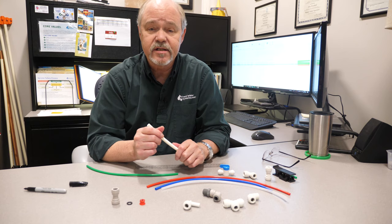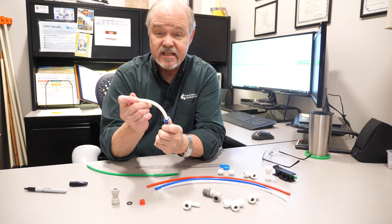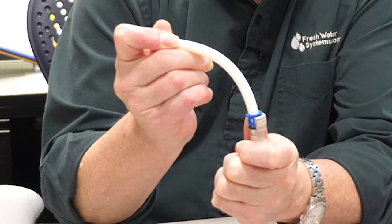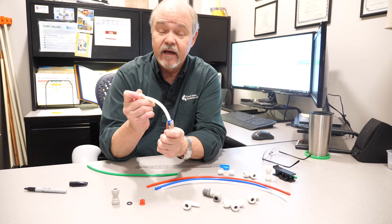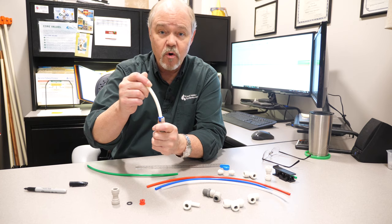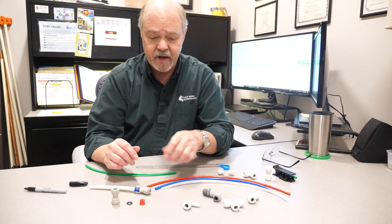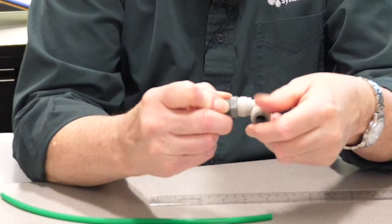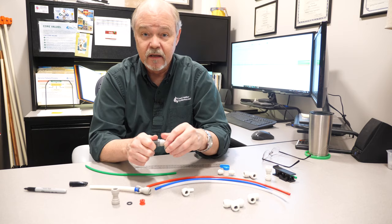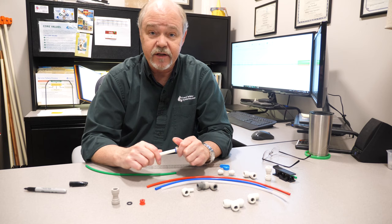Finally, the last common cause of leaks is when you put a tube into a fitting and then try to make a corner or a bend — what I call side torque. As you can see, the collet moves to the side, which also stretches the o-ring so it's no longer making a good seal around the tubing, and it's going to leak. It's always important to keep the tubing coming out of the fitting as straight as possible. They make a variety of configurations to help with that — for example, elbows and swivel-type fittings where you screw it in and the fitting can swivel — making it easier to make corners and bends without loading up the side torque on a fitting.